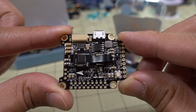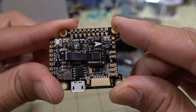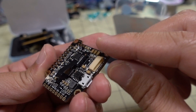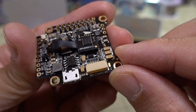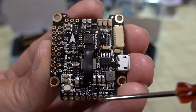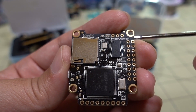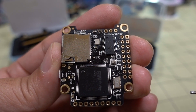Here's your pretty much standard looking board, 30 by 30. It's got an MPU 6000 gyro up on a dampening piece of foam right here. You get your arrow showing the forward part of the quad — that's how it should be pointing. This is the top USB port over here. You have a connector that goes to your ESC for your motor, and also telemetry. All of your connection points are labeled or silk-screened on the top part of the board, but on the bottom part none of those are silk-screened. You can pretty much be safe to solder everything on top.